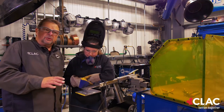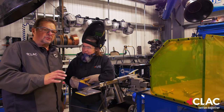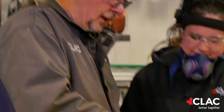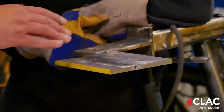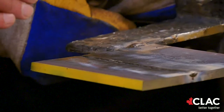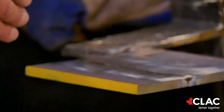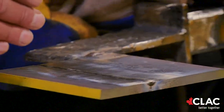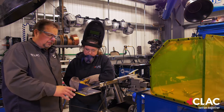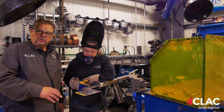What most welders are looking for when they're welding is a super smooth, pretty bead. When you're doing overlay, it's not going to be super pretty — it's going to be lumpy, thin and thick. And eventually as this starts to cool, it'll start to crack. Those are stress relieving cracks — you can hear it going on right now. As she continues welding across the plate, there'll be more of it.